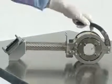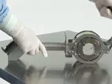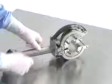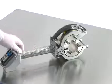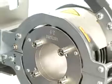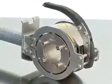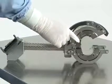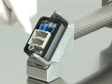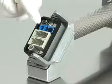The newly designed SIB3 weld head features an updated positive clamping system that allows the operator to lock it open during weld preparation. The stainless steel handle keeps cool during the weld cycle, while the weld head reaches a temperature of 400 degrees. The internal cleats provide the compression needed for the fusion process. The back of the handle has the locking connector for the electrical and pneumatic control cable.